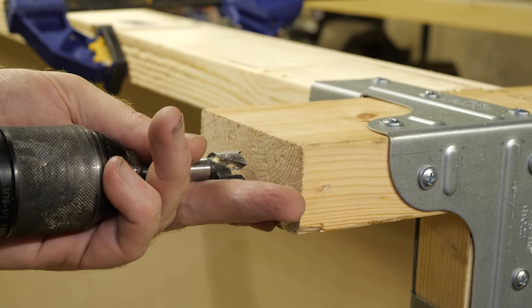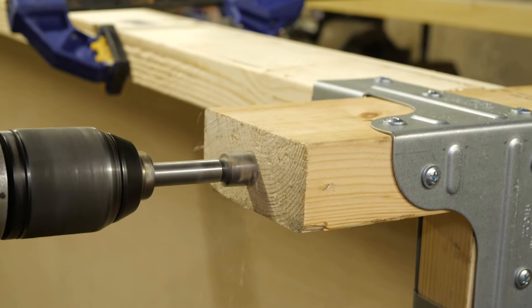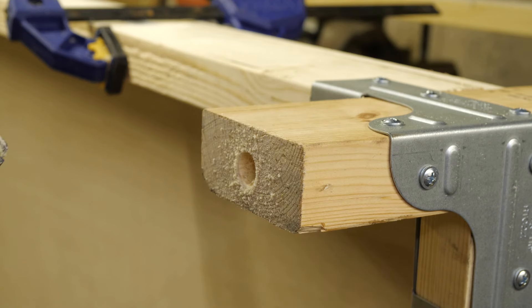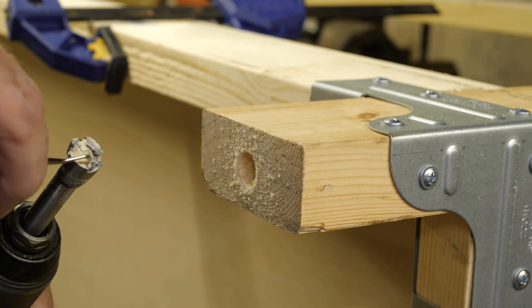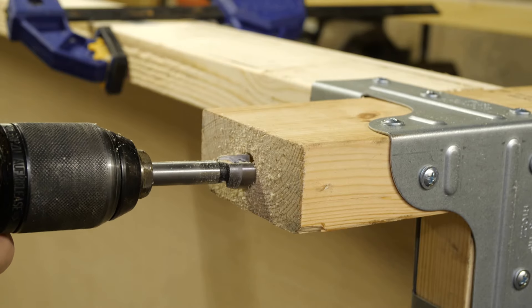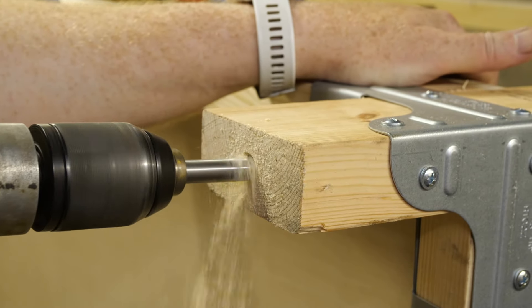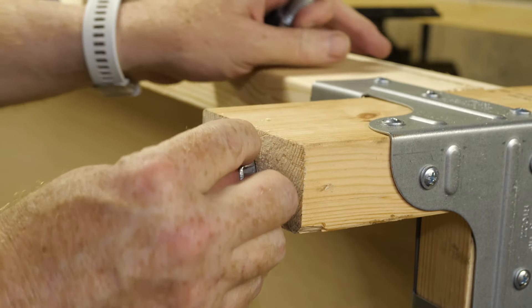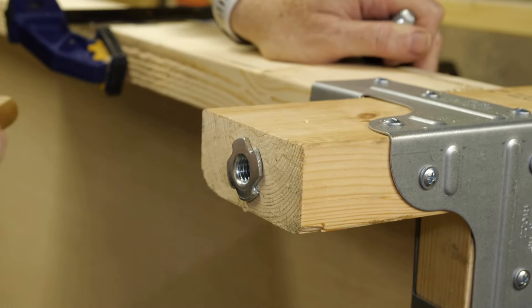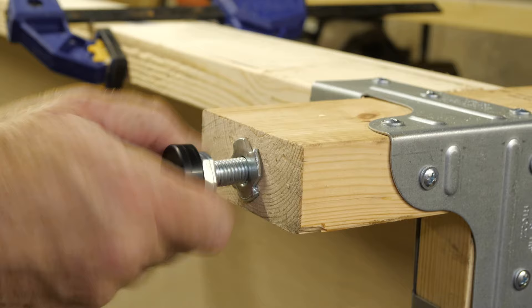With the frame tilted onto its side, I drilled large round holes into the bottoms of the verticals. My forstner bit set is cheap and nasty, and I had a really hard time getting these holes deep enough — they clogged really easily and were clearly losing their sharp edge. The hole accepts a threaded steel insert with spikes to hold it firmly in the wood. I could then thread an adjustable foot into place, allowing me to trim each corner to help level the bench.